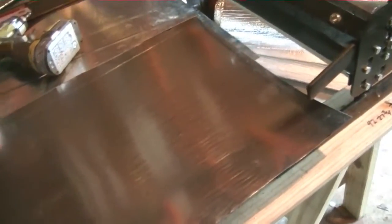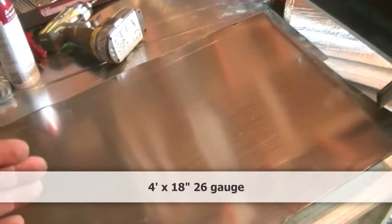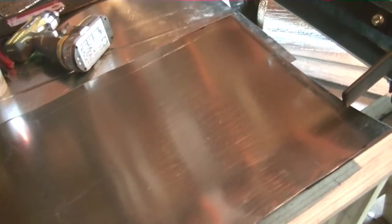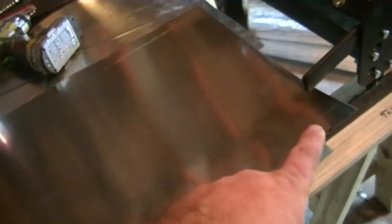These particular boxes are 14 and a quarter by six and a quarter by 17 inches deep with a one-inch flange. I have a piece of metal I cut out already — it's four-foot width by 18 inches, because my box is going to be 17 inches tall with a one-inch flange, which adds up to 18 inches. I'll make an end cap for the bottom once we're done.